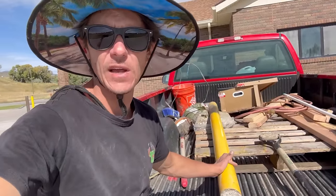A question some of you may ask: how do I determine how big a hole, how deep, what size bollard? The dimensions I chose — pipe size, how much concrete, what type — are all based on past experience. This is exactly the bollard I put in at Home Depot. If it's good enough for a large parking lot where someone could ram into it at 34 mph, it's good enough for a lot that's only 30 feet wide. Before you internet engineers tell me I should dig a 24x24 square 17 feet deep and use a 30-foot bollard — you don't need all that. That's overkill and you'll price yourself out of the job.